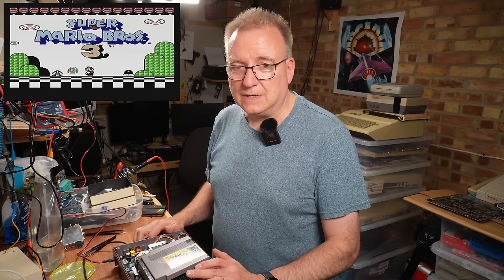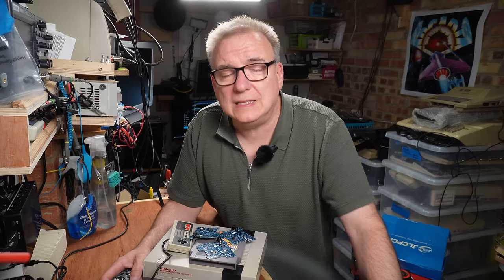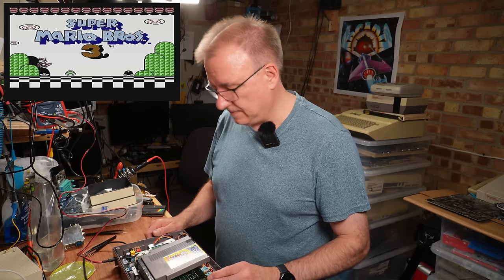That board, I think, will work. Well, no, this isn't actually true. In this pass-through mode, the RGB board isn't actually doing anything. No spoilers for the further mock-ups, but displaying a composite signal in pass-through mode doesn't make this a working RGB NES board. The only real test of this is to complete the wiring and test the output from the RGB side of things. But he seems pleased with his progress.